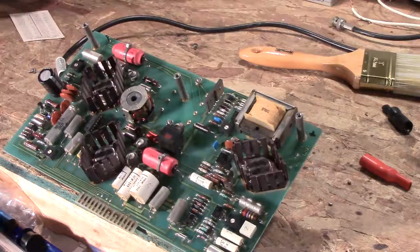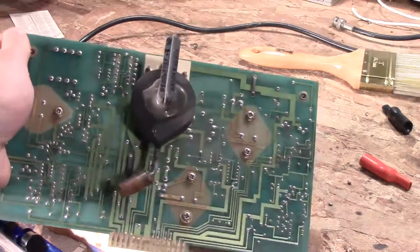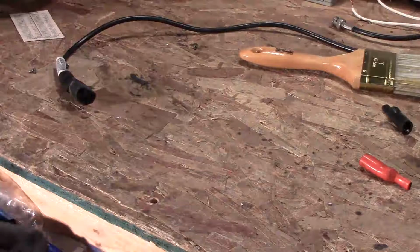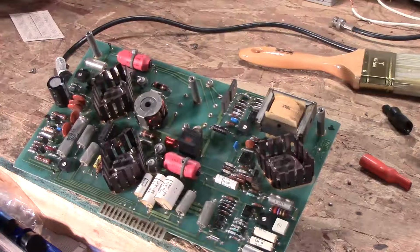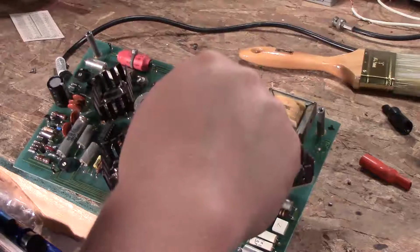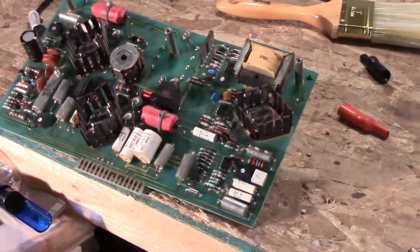Okay, here you see the deflection board and high voltage board. Like everything in the HP, it's quite modular. Got the edge card connector at the bottom. When you look at the flyback, it actually has a little connector for the high voltage lead. So you can disassemble things and leave the CRT in there and leave the connector on the CRT for the high voltage. Now, this is the vertical area here, just in general. And so I was spot checking a few components,